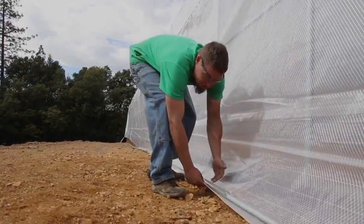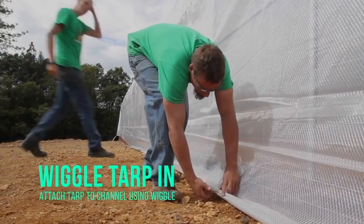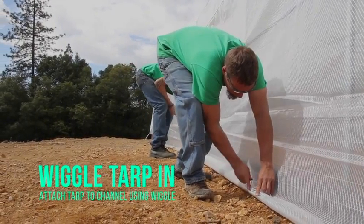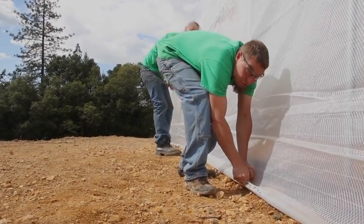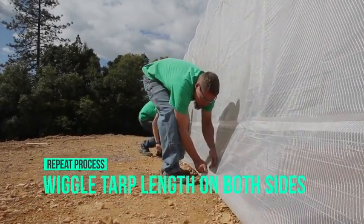Now that we have our channel attached to our roll-up bar, we'll use a little short piece of wiggle wire, put it in the track. And we just want to make sure that we're nice and tight between our connection points.